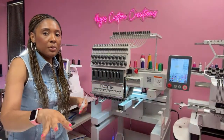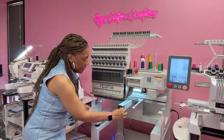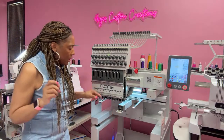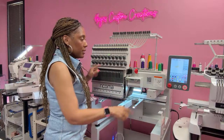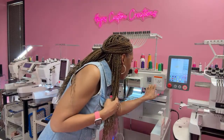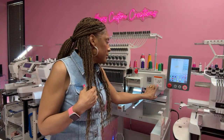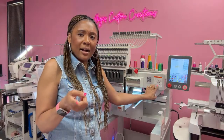Hope you all can see me. So when you begin to work, you just need that one drop over here. Then you put it in, like I said, every 8 hours. And then the bars, you need to grease those once a month. And if you're like, oh my gosh, that's a lot to remember, they actually have it already on here. So it says once a week, 4 to 6 hours, but I do it every 8. Usually I don't run it 8 hours straight.